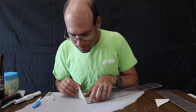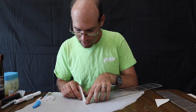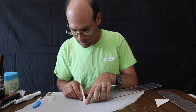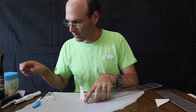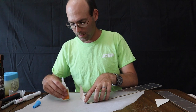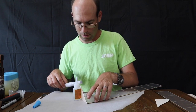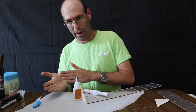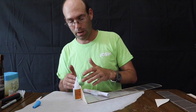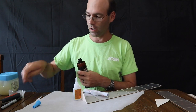And now I'm going to face this, the front up against the leading edge, lay it flat, straight down on the table, and gently press it in against the wing. Now it is important that the wingtip be facing straight up and down like this. The reason is if it's out, it's going to add to your wingspan and you could get disqualified in competition by having too large of an airplane.